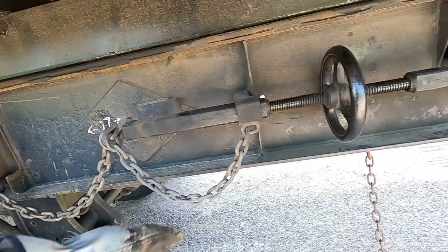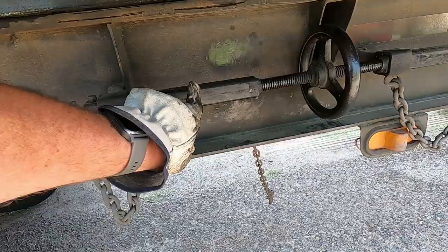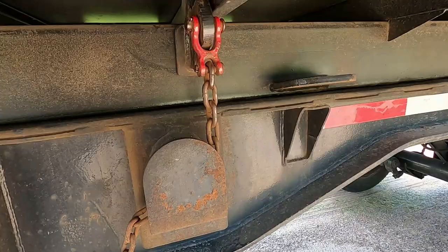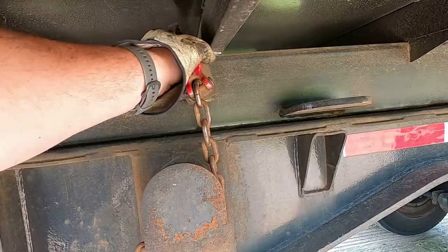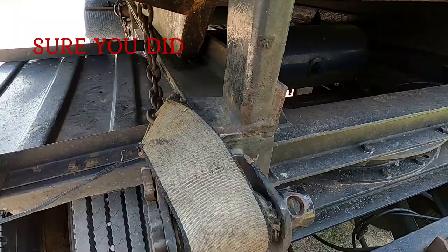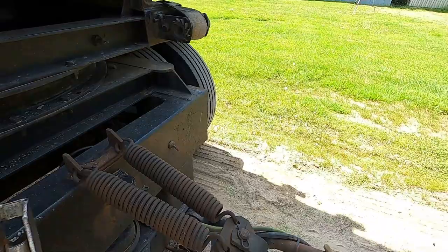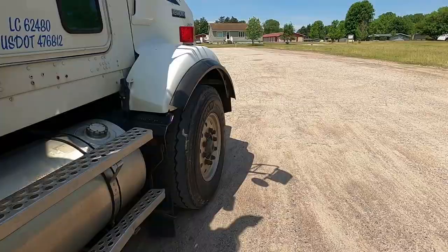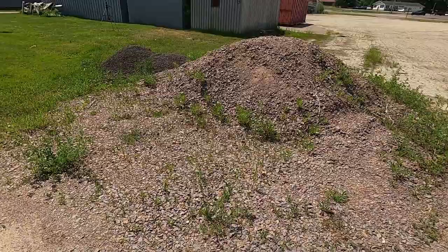And I take this, slide it forward. That's one key thing: I always keep these slide arms really lubricated, and these too, so everything spins so nicely. Because if you have to sit and fight it, then you're losing time, and time's money, right? Then the brackets, like that, sit right over on that ledge here. Drop that down, and then we're coming to our last hook spot, which I loosened up earlier. Disconnect it, and then you know you're completely disconnected. That procedure is done. That's probably the easiest way to do it so there are no mistakes and nothing's forgotten. I'll show you how I reconnect everything too. I go in the same procedure.